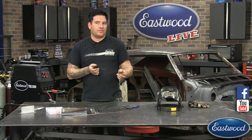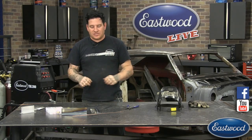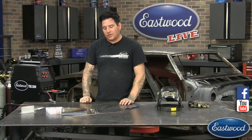But otherwise, you shouldn't hear a sound like you're getting an arc that's jumping, that's inconsistent, where it's bouncing back and forth. That's where you might have something, you don't have a good ground, your piece isn't cleaned well enough. If you start hearing it kind of buzzing and jumping around, that's the one sound you can hear that you're not correct with aluminum. Steel really doesn't make any sound when you're TIG welding. It's mostly just the sound of the gas coming out. So you can't really listen as well with TIG welding on steel to know that your machine's set up properly.